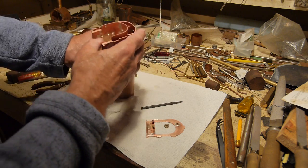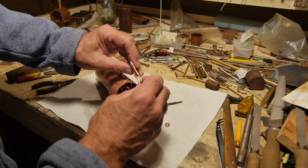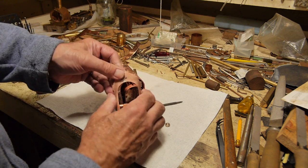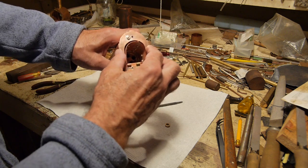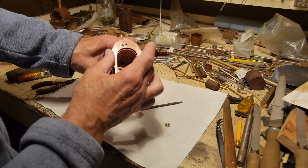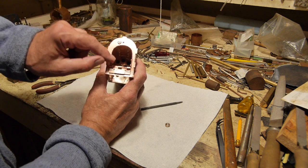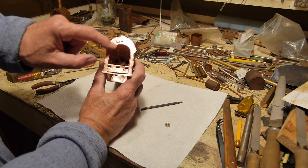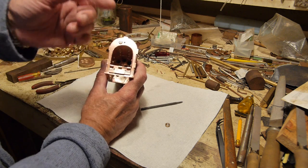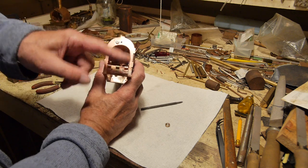So that's the other piece. Now this is the back head, and I took a design from a Japanese live steamer who made a small boiler like this — you can find him on YouTube. Because the back of the boiler is dry, i.e. there's no water space as there is on the sides and the front, most boilers are like this to give a little bit of extra length to the grate. What he did — which I thought was really cool — was make the whole back head of the firebox, right from the crown down the sides, into a hinge door. Now this isn't the firehole door; this is just to get in and service the firebox. It's not the firehole — just to allow access to the grate.